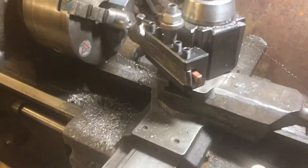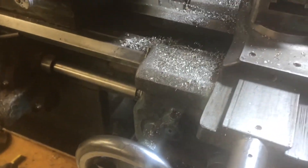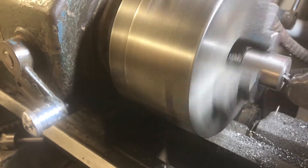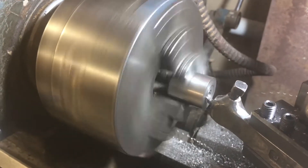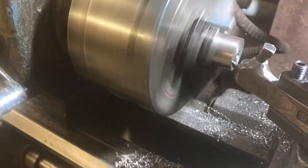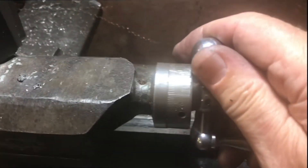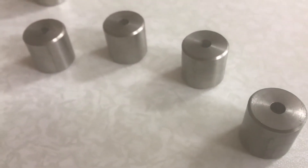Move the tool towards the center where there's a small center hole, advance it a little bit, and cut. Do a series of cuts until you get down to the zero mark. Now we've got an even face right across the front, which is at the length that is 1.6 millimetres too long. So you keep making cuts until the dial reads 1.6, and you now know you've taken 1.6mm off the length — that's how we get the length just right.